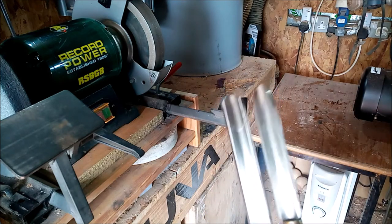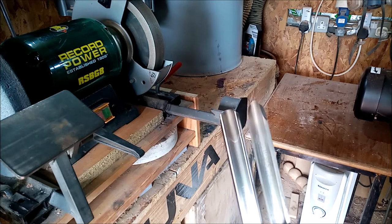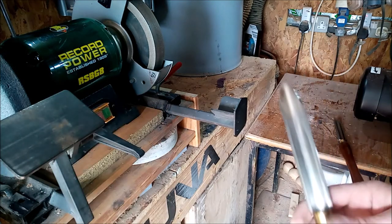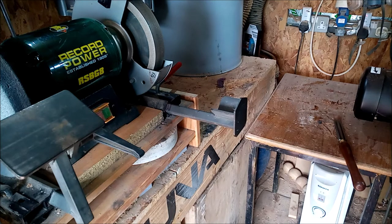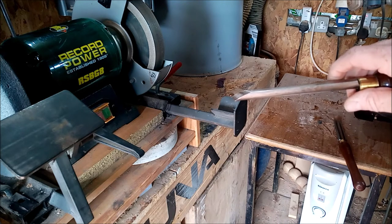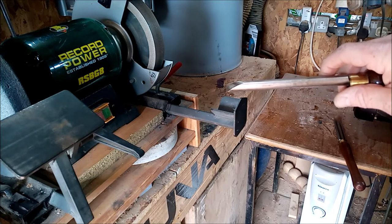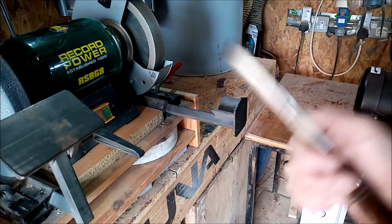Now, I did a video on a crown bowl gouge. I'll leave a link below, Brendan, and I'll stick one up there. It's the exact same grind, and the exact same method. There's no point in me telling you what that angle is, because that's my preferred angle. I know it's round about 60, but it's not exactly 60. What I'll say to you is, whatever grind you put on your bowl gouges, use the same grind on this.